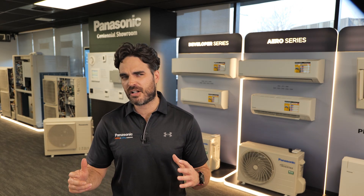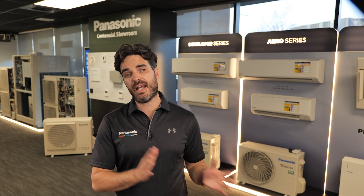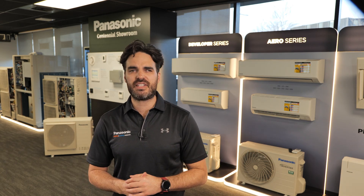On the controller there are 6 modes that you need to be aware of. Continuous, which is between 37 and 59 degrees — it measures the water temperature at the bottom of the tank and when that temperature gets down to 37 degrees it turns on the heating until it reaches 59 degrees. Hours off-peak, which is on between 10pm and 7am only. 6 hours daytime, which is on between 10am and 4pm. You can also set up two independent timers of your choice. And a one-shot boost button which turns on the heater until it reaches 59 degrees.